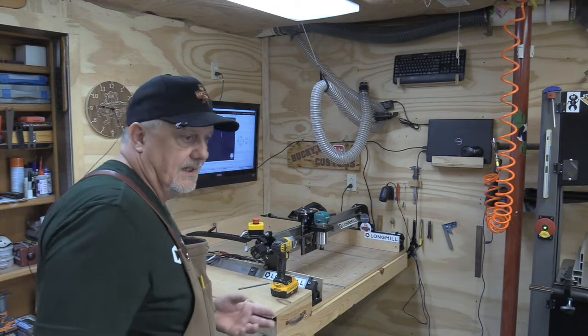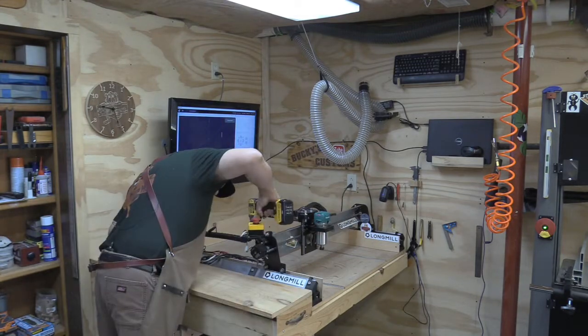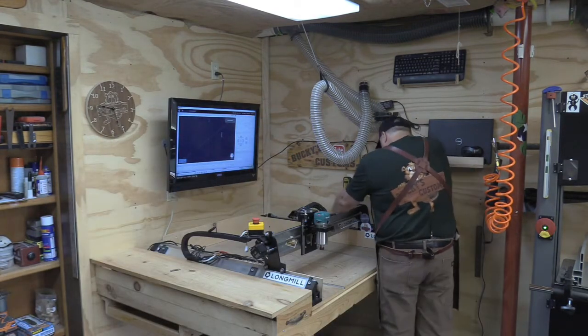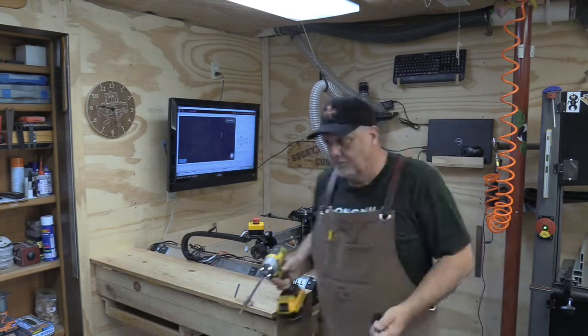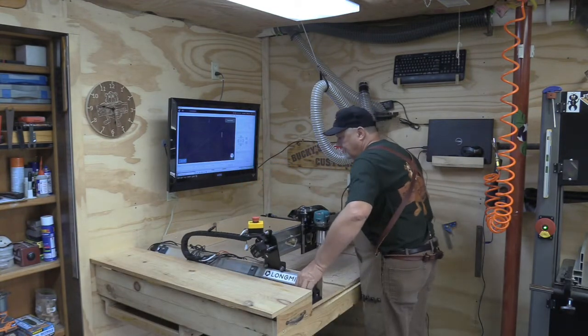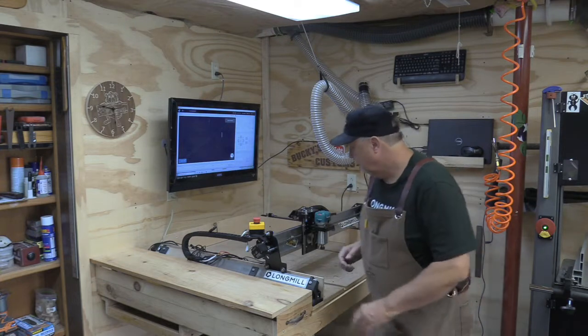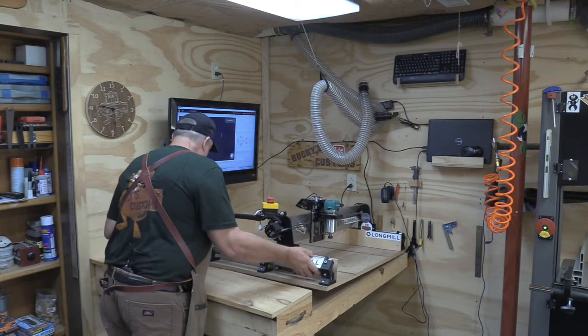All I'm doing is just setting that stuff aside and getting it out of the way, basically. I made this thing so that I could take it apart easily enough, and this is the first time I'm doing it, so we'll see. Now you see me unscrewing from the legs on the mill itself. I've drilled holes and attached the mill straight through into the second wasteboard. By removing those screws, it keeps the front screws installed into the wasteboard and enables me to lift it up and out.